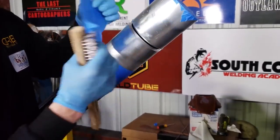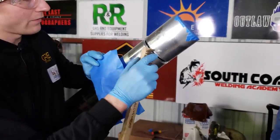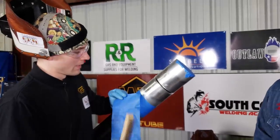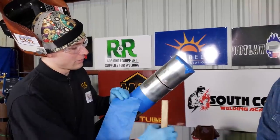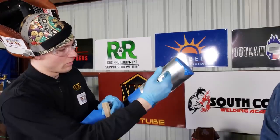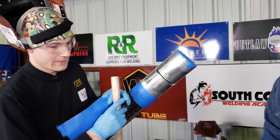And basically, the reason is that when I heat up the tape, I do not want any of this tape residue in my weld zone and heat affected zone, or even anywhere relatively close to the weld zone. If there's any tape residue, when I start brushing the weld zone and heat affected zone to remove oxides, I do not want tape residue brought into my weld zone, especially if tape residue contaminates my hand brush, which ends up in my weld zone.